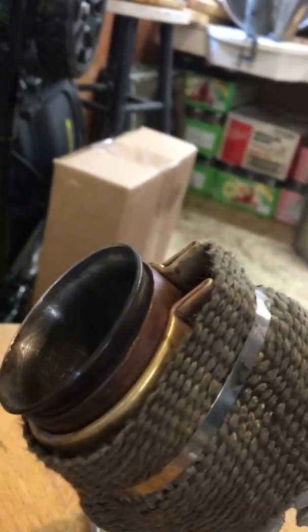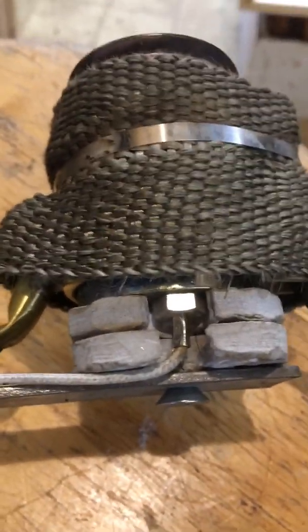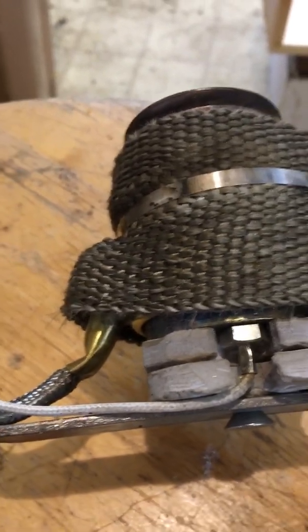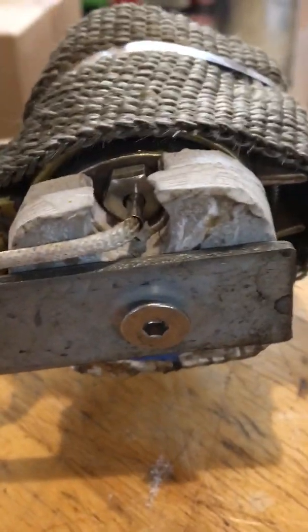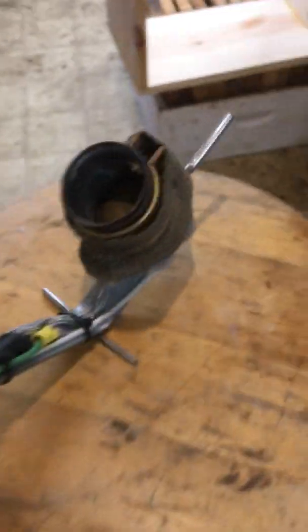The parts on the board: a stainless steel cup, flared copper sleeve on the outside for thermal density, brass band heater, and I brazed a stainless steel quarter-inch tube — the copper ones bend and I didn't want that. Recent design change from one ceramic chip to two ceramic chips to protect the thermocouple wire. Changed to a regular hex head stainless steel bolt and a 3/16-inch bar — slightly thicker, easier to weld the cross stand. Ground is pop-riveted in, and there's the band heater.